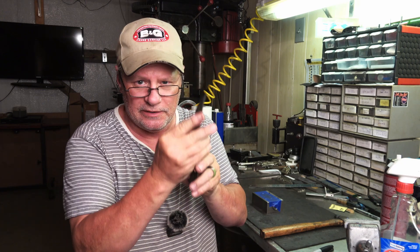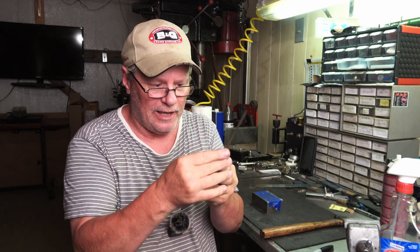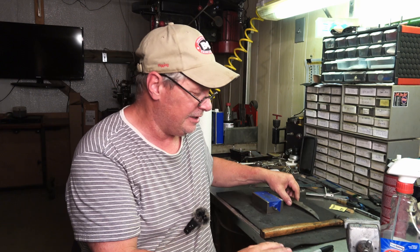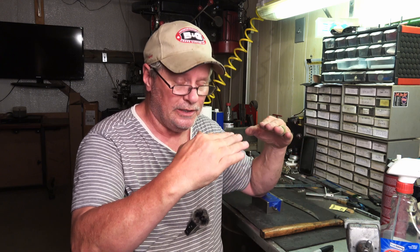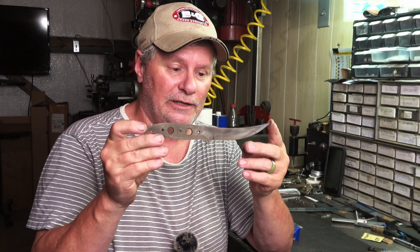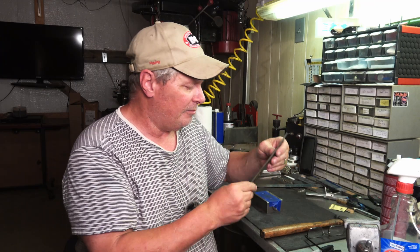It works very well. There are little marks in there but they'll be ground out. Keep in mind about the ricasso area — you can mess up your blade; you might have to try something else there, like a pin press or some kind of press to just bend it. But I've broken many blades doing it that way, especially narrow ones. In fact, the development of this technique came from a broken fillet knife that I was straightening in a press.